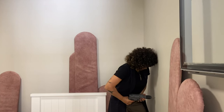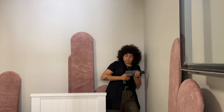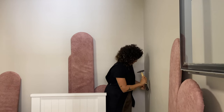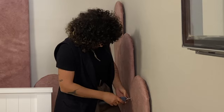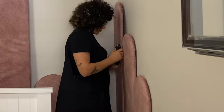After all the pieces were connected together, I placed the assembly on the wall, moved it up and left and right to find position, made a few little marks where I wanted the holes, then took the boards away and started drilling. You basically need one hole for every single connector between one board and the other. Put a plastic anchor in every hole, then pass the screw exactly through the connector and into the wall anchor. That's how it works.